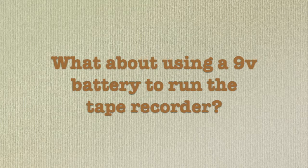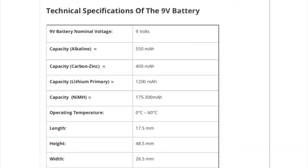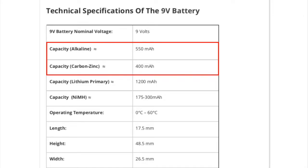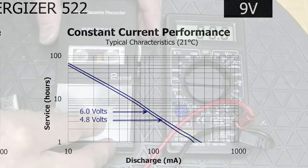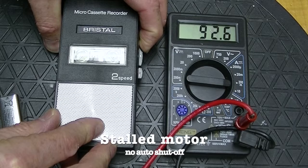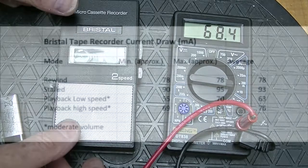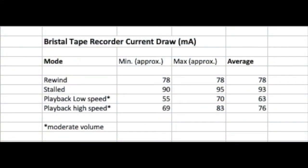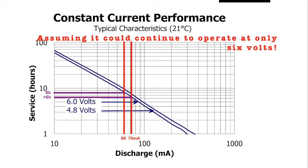According to the instructions, a battery is supposed to last about 5 hours. I wonder if that's true? This chart shows 9V battery capacities of different chemistries. Unfortunately, these aren't the useful capacities, because the capacity is a function of the load. I decided to conduct a quick experiment just to see what kind of numbers I'd get. In different modes and different speeds, I tabulated the data and found that the typical draw was between about 60 and 70 milliamps. Using an alkaline battery should last between 6 and 8 hours — that was quite a surprise to me.